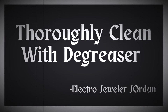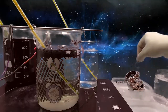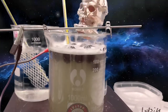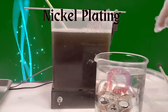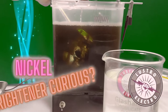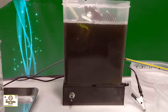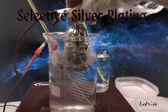Before going to the next step, thoroughly clean with a strong degreaser. Now the copper electroformed skulls can go to the next step — one of them will be nickel plated and the other given a patina. Both will now be electrocleaned. This is a very quick process; after electrocleaning only handle with gloves as any dirt will spoil the surface. Now we are going to nickel plate — it is a very fast process taking only about five to ten minutes. If you are already electroforming, nickel electroplating is a really great process to add to your skill set, especially if you want to add gold or silver plating to your repertoire. I am using Lustro Electro Bright Nickel Mix and Lustro Electro Nickel Brightener for all my projects.